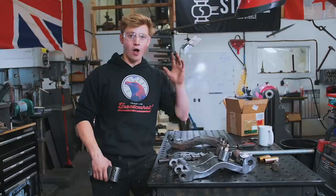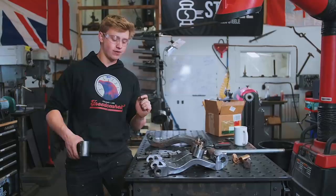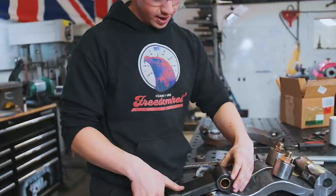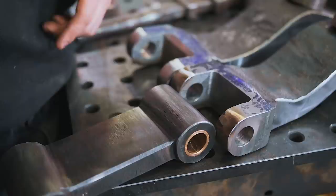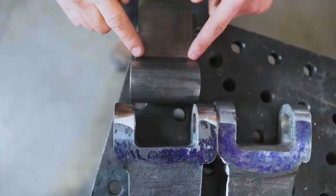The toggle arms are pretty much finished — we still need to pop those bronze washers in, but we're waiting on a delivery of oxygen so we can get them hot enough. What we're going to do now is mill down the toggle links that Alec made a couple of episodes ago. We'll mill an equal amount off both sides so they'll fit inside the side arms. I forged them a little bit small, so I'm going to sacrifice a little bit of width on the toggle arms to make them fit.